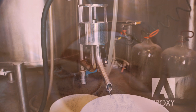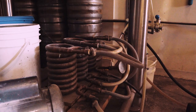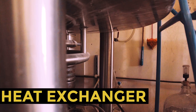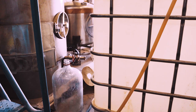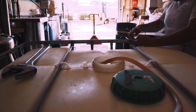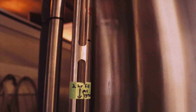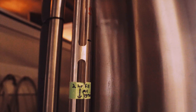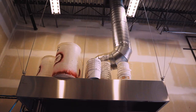Since there's not a lot of space, the IBC that has fermented the most dry — which is IBC number three — will be distilled first. At the end of the workday, the heat exchanger is turned off. Since there's no longer any cooling water to cool down the wort, the temperature of the wort being collected into the fermenter is warmer. But Scott doesn't see this as an issue since the IBCs are filled with so much cooled wort already, so the heat from the warmer wort will be dissipated by the cooled wort that's already in the IBC. The wort is trickle-collected into the IBC until 2,700 liters has been collected in total. It's already 5:30 pm and this trickle collection will continue overnight, until around 7 am the next day, at which point the pump will be turned back on to maximize wort collection.